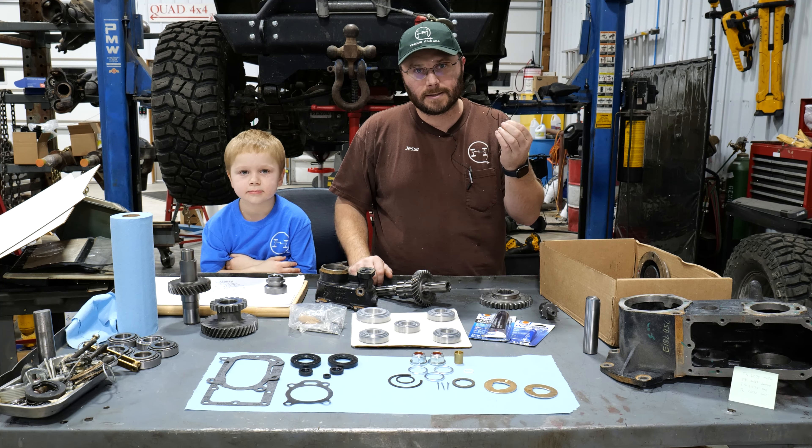These gaskets are original equipment thickness and original equipment material. These bearings — as long as we can still get them — all the tapered roller bearings are USA Timken, with the ball bearing being a Nachi Japanese bearing. With everything that's going on in the world, sometimes Timken USA is hard to get. We've had some Timken from other countries and have also had to sub for Koyo Japan or Koyo USA. At least right now I've got Timkens for the tapered bearings, but if we did have to sub to Koyo, that is also a very good bearing.